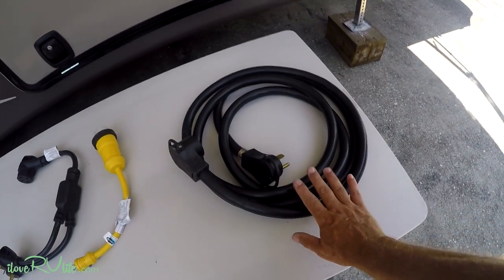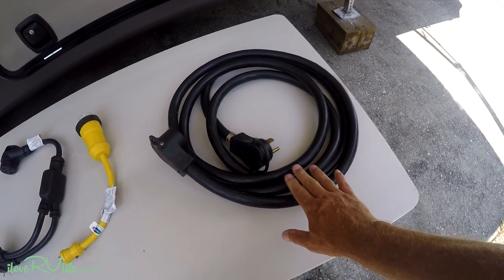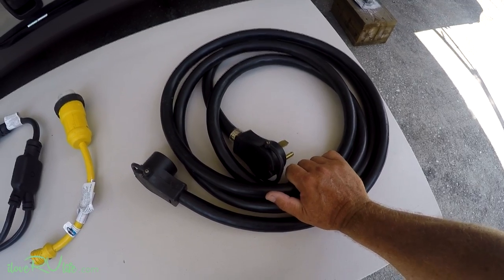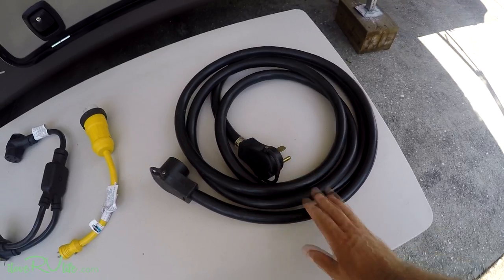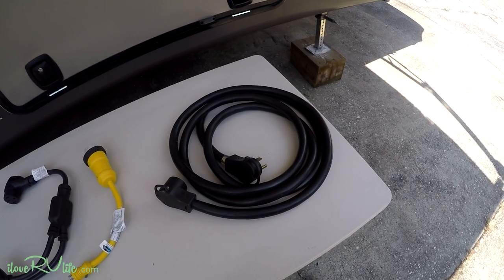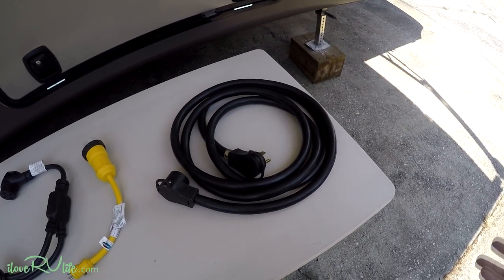So this is a 15-foot cable. Now, again, let's talk about buying quality, and not having headaches later. This is an 8-gauge AWG cable inside here. Very thick, very large wire. You don't want to go with something cheap and thin. If you end up doing that, then you end up creating a fuse or a point to where the cable will heat up, and you will lose power, you'll lose amperage, it will cause you problems.